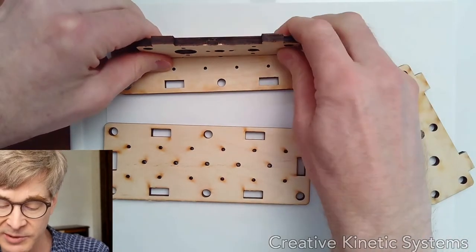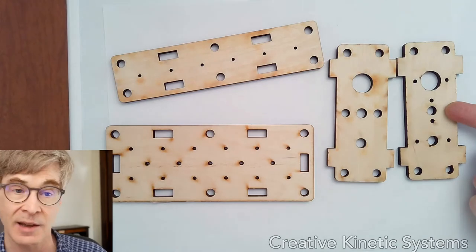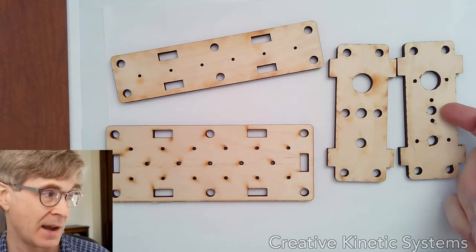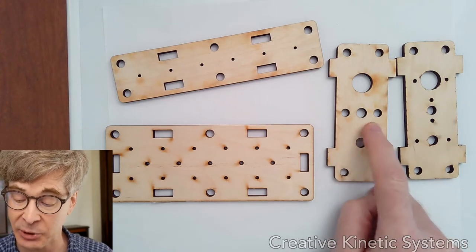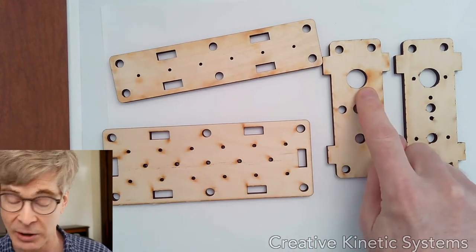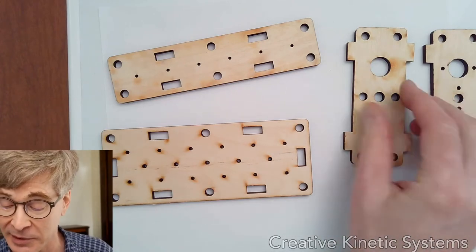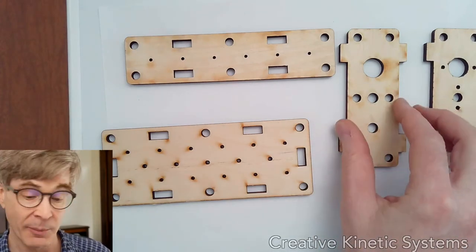Several parts are provided so you could build a full box. There's a variety of holes, and the two side pieces are actually slightly different — one has a hole pattern for the gear motor. Due to some last-minute gear motor changes, there are actually several parts with several different hole patterns, so any individual part may not match the gear motors you have and you'll need to figure out which is the best fit. There's another part with bushing press-fit holes that could accept a shoulder screw, a bushing around a shoulder screw, or a larger hole for a ball bearing. These are provided in a speculative way as examples of flat-pack design involving building structures from parts and using bearings.